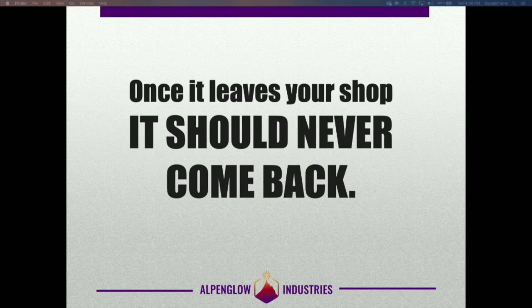So how do we avoid becoming this cautionary tale? One thing is to have this perspective in the back of your mind during the design process: pretend that there is no such thing as return shipping. Think about putting something out there and never seeing it again. This is different from software where updates are easy — for a physical good, returns and repairs are really expensive. If you keep this in mind while developing, you'll think about what could possibly go wrong with every component, how to fix it, how to instruct the user to fix it, and whether parts are user-swappable. This guides you toward designing something easier for users to repair, which also makes it easier for you to assemble.